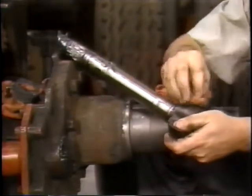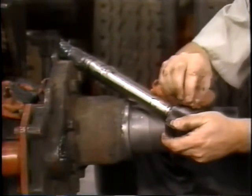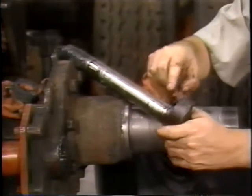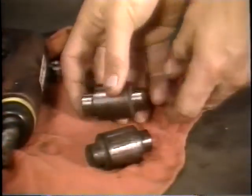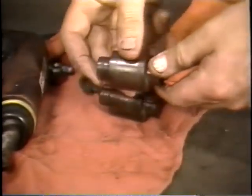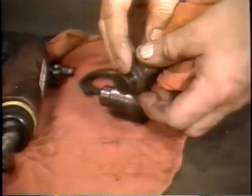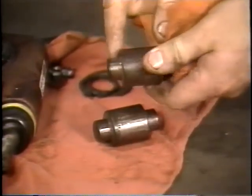Remember, Q and Q Plus cams are different. Also, look for brinelling of the S-cam. And finally, check for flat spots on the rollers — this could be a result of improper greasing. Remember, only grease the roller areas that contact the shoe web and not the part that will contact the camshaft.